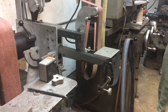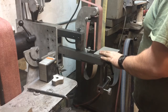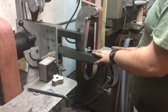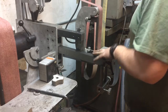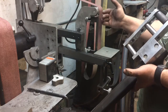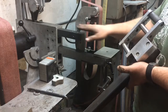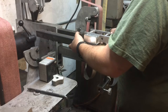I wanted to make a video tonight and show you more or less the finished work table or work rest assembly, at least for the flat platen. This probably isn't going to work the same way for the small wheel arm or the 8-inch contact wheel. Just to give you a quick visual on why that is — this flat platen has a lot of surface area to take up a lot of the 72 inches of belt, and because of that, this tool arm actually goes further into the body of the grinder than the small wheel arm would.